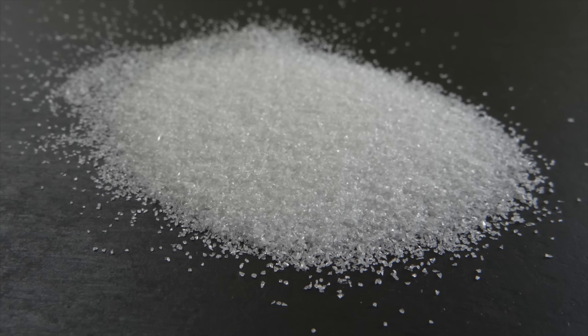Aluminum oxide, on the other hand, when it gets worn down, the pieces get smaller and smaller and smaller, but kind of rounded. So they don't break, they wear down. That makes it good for polishing, and I usually use it at the end. The polish that I use in my tumblers is aluminum oxide. And the 500 grit I use is aluminum oxide because I'm getting ready for the polish stage.